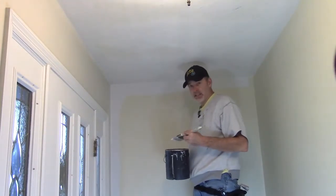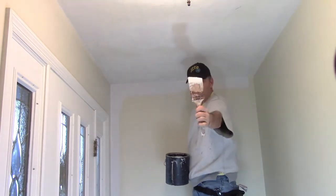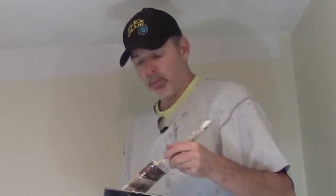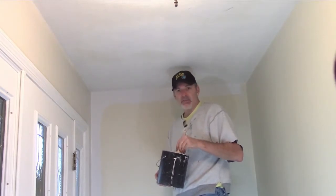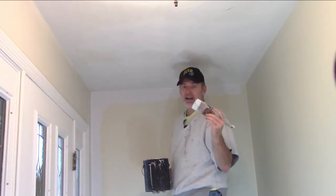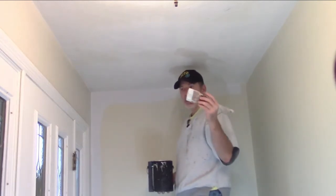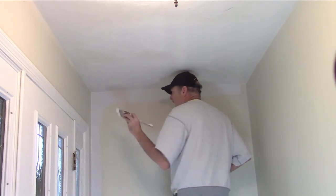You can see cutting in is really easy. When you're loading your brush, you're not dunking it. There's only about half to three-quarters of an inch of paint on that brush. You dip a little bit — I have maybe an inch of paint in this work pot. You dip and pat it on the inside of the paint can. Why would you want to load paint on there and then wipe it all off? More paint is actually going to give you a cleaner edge — it's counterintuitive but it's not, because you'll get a nice flow of paint right where you want it.